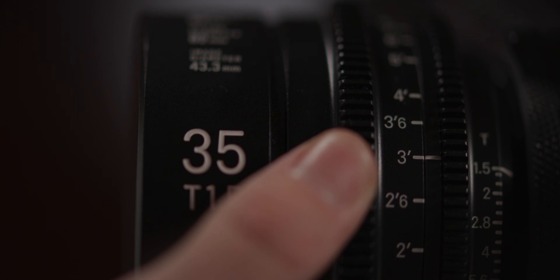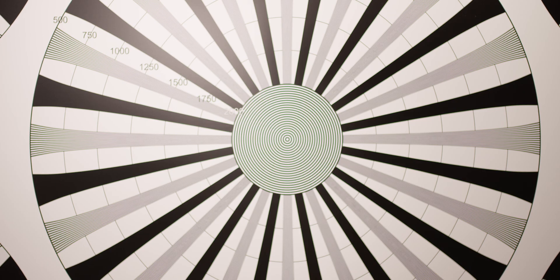So let's say the lenses are coming up consistently short on your camera. Don't forget to make sure that the sensor is unlocked. Rather than fishing for focus, set the lens to the exact distance that the chart is taped out to. I have this lens wide open and set to 3 feet on our 35 millimeter lens. We can watch our monitor and ease in the focus by turning the back focus adjustment on the front of the camera with our T10 Torx driver. Since it was coming up short, we'll rotate very slowly counterclockwise until we see it hit peak sharpness on the chart. Once you feel like you're there, give it another round of finding focus on your monitor to make sure your average focus lands on the mark. If it's still coming up a little short, or maybe you've gone too far, set the lens back to 3 feet and make another small adjustment until you're happy with the results.